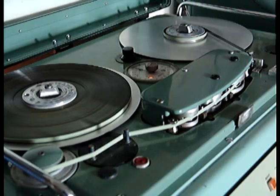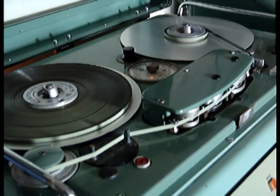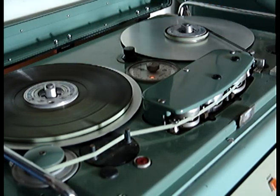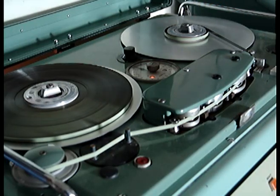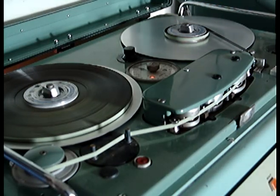The AEG DINs are something that came off the German Magnetophons and the Tonschreiber machines. Not very popular in America or in England. However, the early EMI machines could use this format. The BTR1 used platters and the BTR2, which is an equivalent of this machine here, also could use them. These are 11-inch platters, which could be purchased from EMI with complete tape on one of the platters.